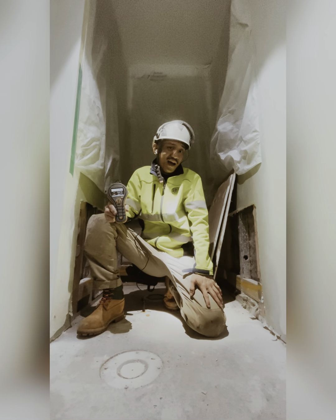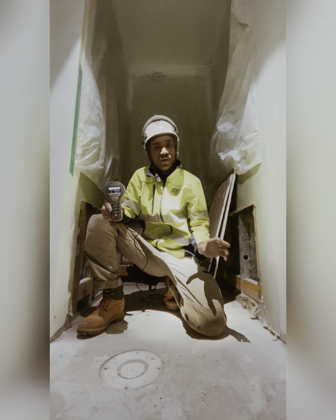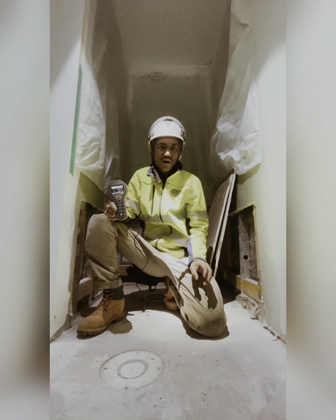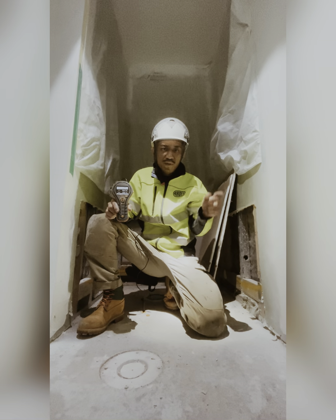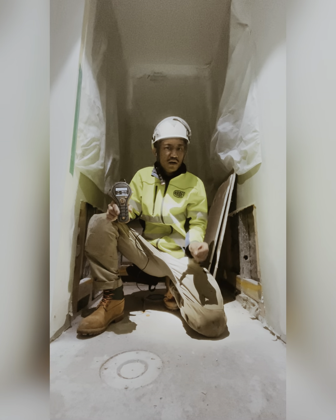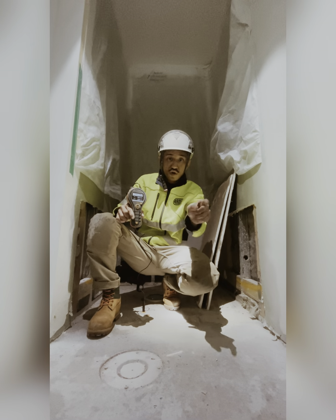As I said in my last few videos, in New Zealand waterproofing and New Zealand concrete standards, the relative humidity in the concrete will be very difficult to reach 75% RH. So please be aware of what is in your substrate.